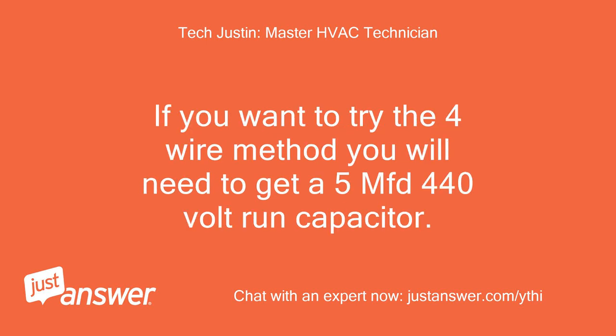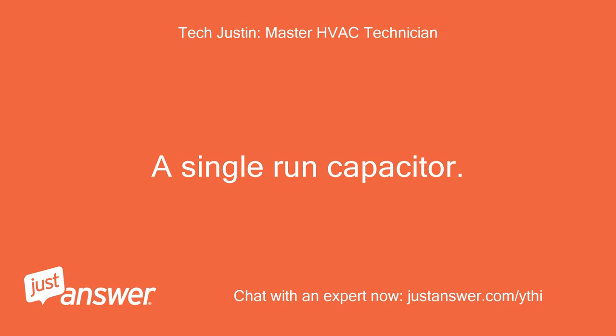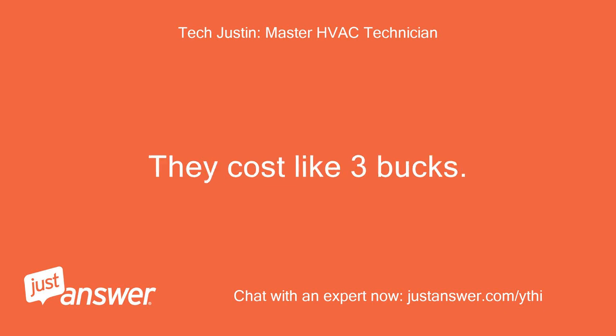If you want to try the 4-wire method, you will need to get a 5MFD 440-volt run capacitor. A single run capacitor. They cost like $3.